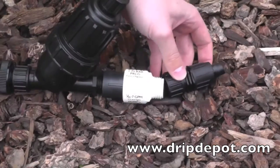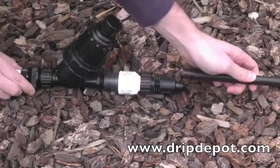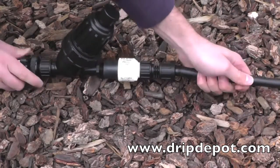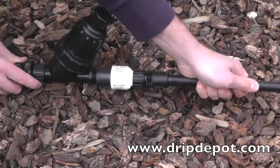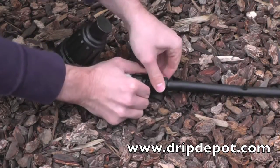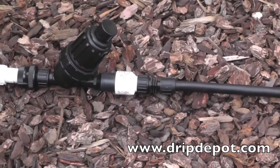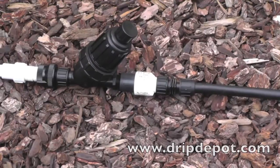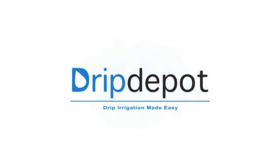The last item would be your tubing adapter. To use the permalock fitting, rotate the locking nut backwards. This exposes the barb. Push the tubing completely over the barb. Sometimes wiggling the tubing back and forth can help the tubing over the barb. Then rotate the locking nut forward. This will secure the tubing into place.